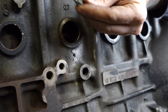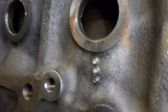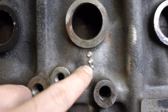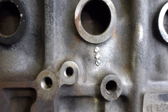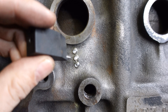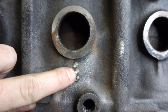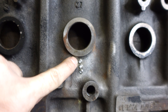Maybe stuff your freeze plug holes with a rag so you don't drop anything in there. The first set of pins are installed, and as you can see the shoulder has some decent depth to it — I couldn't get it all the way in because I wouldn't have enough thread. The way to fill the crack further is to grind these smooth, drill a hole in between them, and use the spacer again — that would put one in between those two and one above, essentially giving you almost a weld on that entire crack. So I'm going to go ahead and grind these down and then install the next stitching pins.